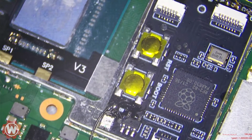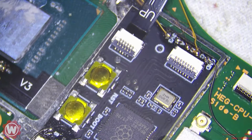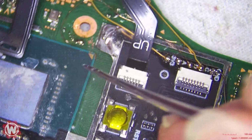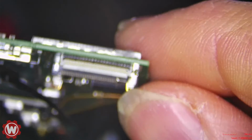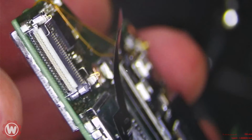Let me take this phone call here so you guys can see. All right, so maybe I had not connected the CPU cable here. I don't know, but everything tests good. It seems like it's working fine. I haven't put it in the LCD or the OLED yet. However, I did notice when I was trying to do the LCD that, look, this is bent. So this is going to have to be replaced.